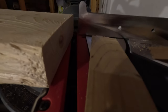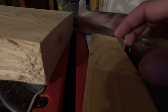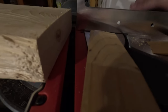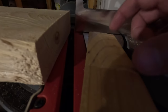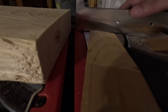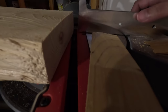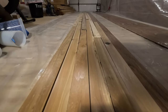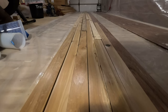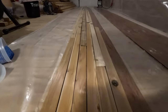This is about an 8-to-1 scarf ratio. I made this so it would be about four inches roughly. I did my calculations and the angle should have been a little over seven degrees, so I just made it eight degrees. As long as I keep this unchanged I should get the same angle on all the other pieces and they should match up fine. Now I'm just roughly dry-fitting the cedar planks.